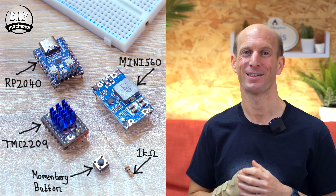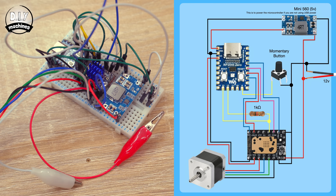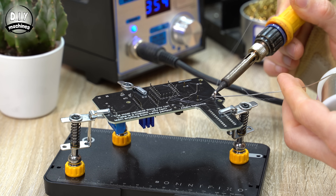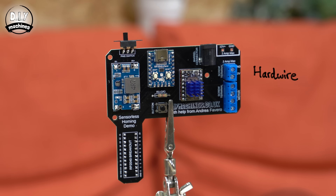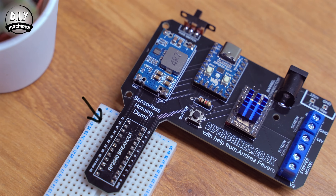We're going to briefly go over how to put together the physical circuit now. To follow along, you're going to need just a few components. I have put together one on a breadboard using some jumper wires following the wiring diagram. You'll find links to all of the individual components and some kits available on Amazon and Etsy down below this video. To make things tidier, I have also created a little PCB which holds all of the components together nicely. If you want to assemble one of your own, just insert the components through the board where they're labelled and solder them into place. The PCB allows you to power the circuit with either soldered wires, wires attached with a screw terminal, or via a DC barrel jack. You're also able to attach a breadboard at the bottom, giving you access to all of the pins of the RP2040.